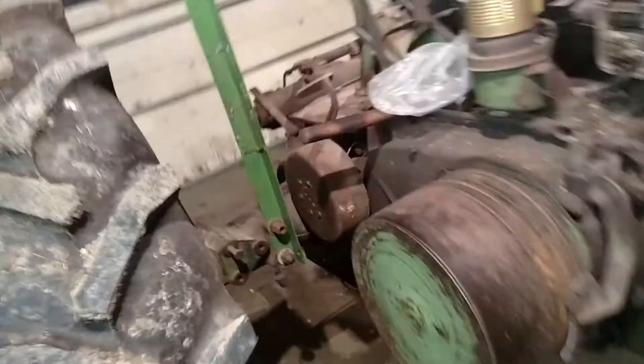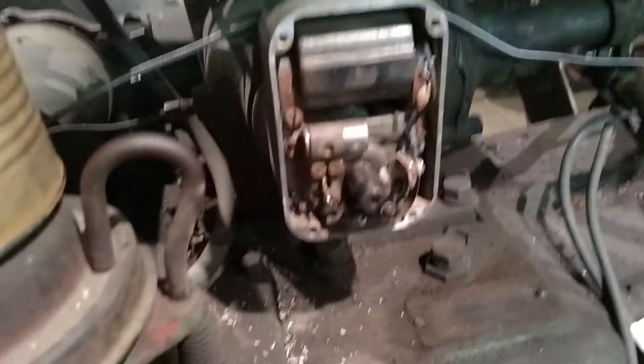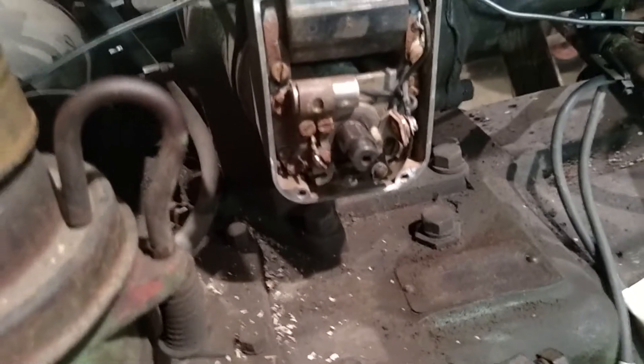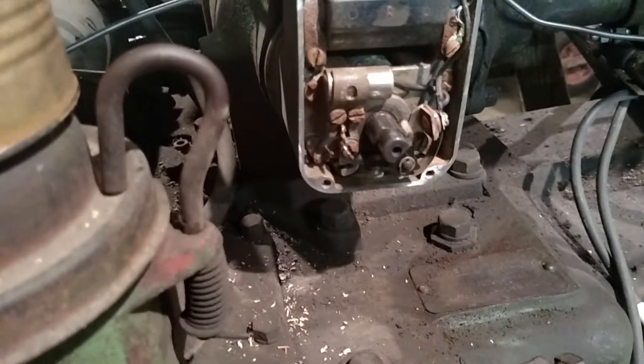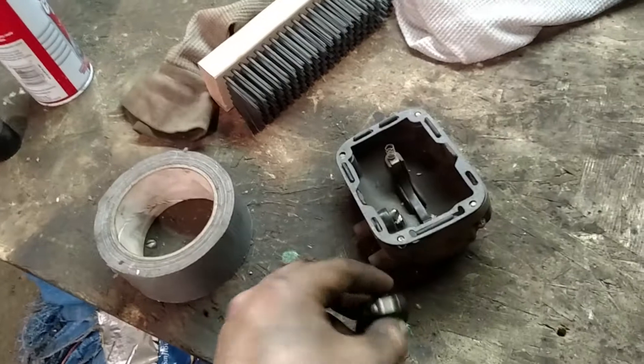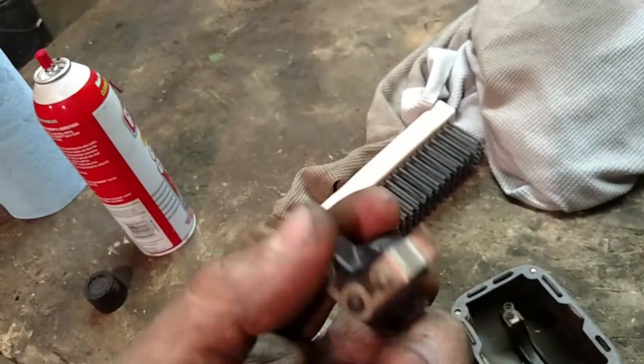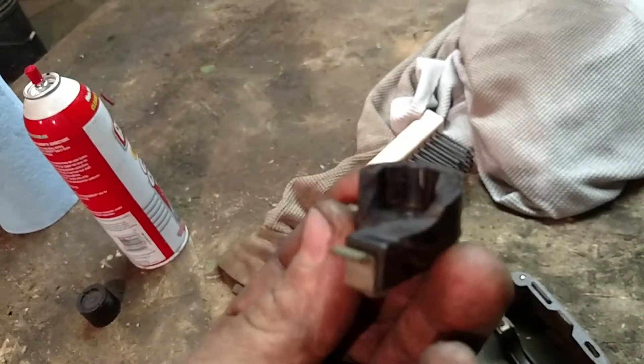Well, I had a slight issue with the A. I had to tear this little bugger apart. I went to start the tractor the other day and I didn't have any fire - it would not do anything. So I tore that little bag boy apart and come to find this beautiful little outfit. My rotor is busted, snapped clean off.